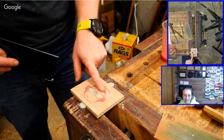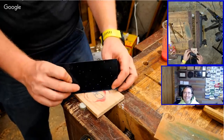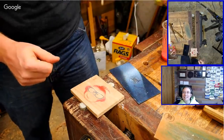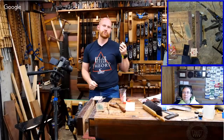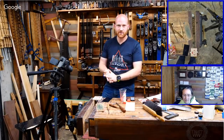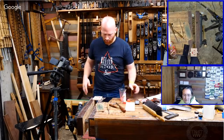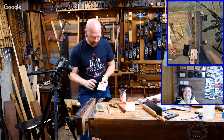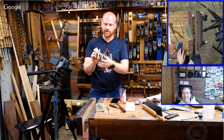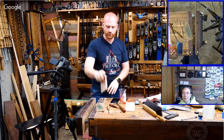When I did my table I hit it with the card scraper, then I got some headlight polish — the same stuff you use for polishing up the headlights on cars — to buff out the epoxy and get a perfectly glass clear smooth surface. The next thing we want to do is cut around this and start making this into an emblem. This is about three-eighths of an inch thick, and in the end it's probably going to come out to about a quarter inch thick.